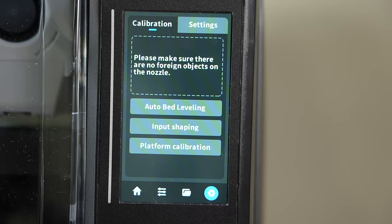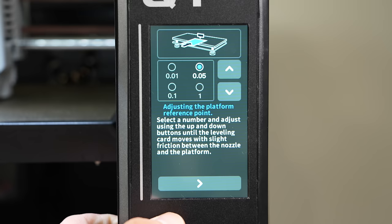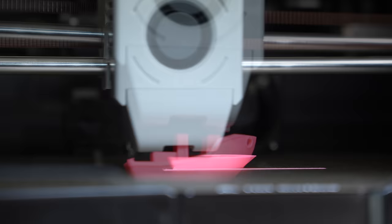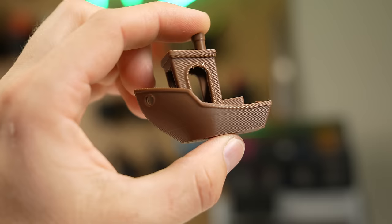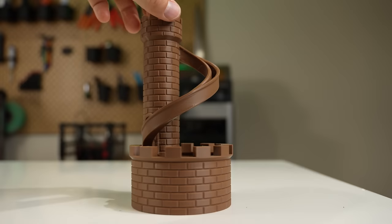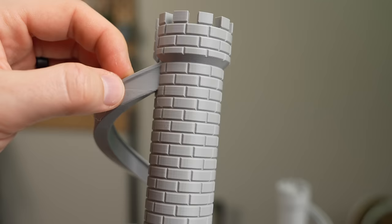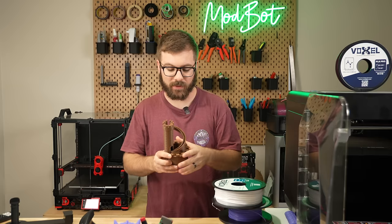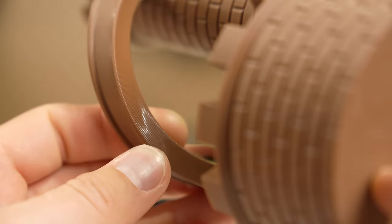The guide leaves off at having you load filament. If you continue with the included paper instructions, it then has you perform a bed mesh and run input shaping before your first print. I did just that before printing a pre-sliced file, which happened to be an 18-minute benchy. I've printed it a few times in different PLAs, and other than some slight under-extrusion visible on the top surface, it's hard to be upset with the results. I also printed the castle slide, which had some stringing but looked really good up until almost the very top. Considering it was untuned with the enclosure closed, the overhangs look pretty clean.